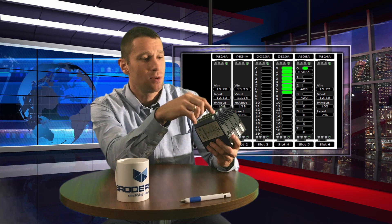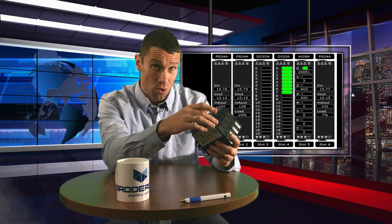With an LED — take one of these modules here with 12 relays, or modules with 16 and 20 digital inputs — we've seen some of our competitors cram together 20 or 16 small LEDs. They are so small you can't see which is on and which is not. And even if you could, you'd still need the diagram to see if it's good or bad when it's on. Because sometimes on is good, sometimes it's bad — like on an old car, if the temperature LED was on, you were stranded. Or for a horn and beacon on a nuclear plant, on is bad. You need the PLC program, the drawings, and the skills to determine if the state is good or bad. So in my opinion, these LEDs are just old-fashioned bullshit. People put that in the specs because they can't do a digital cockpit.